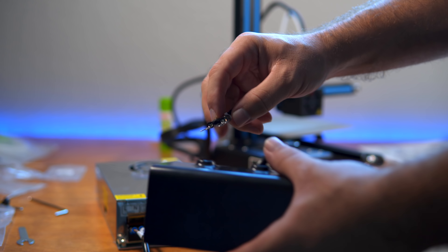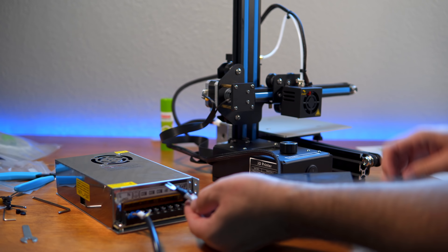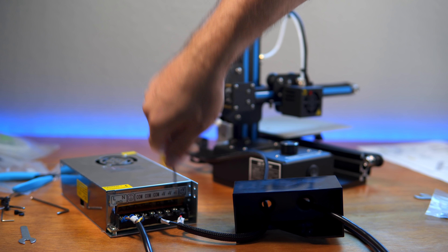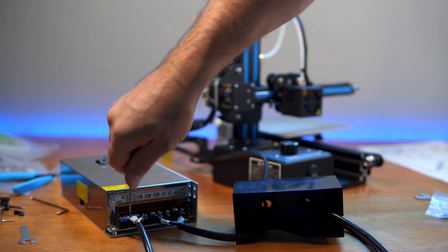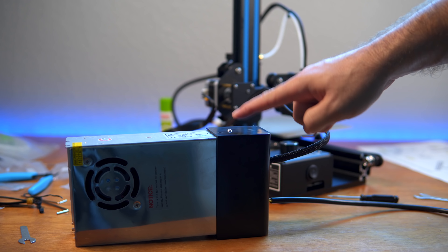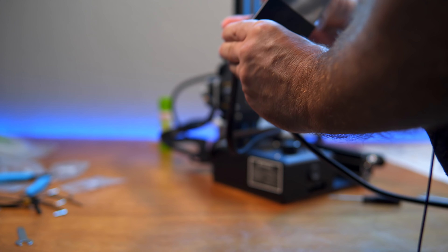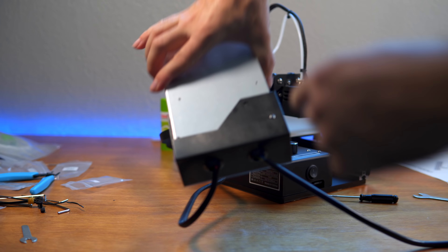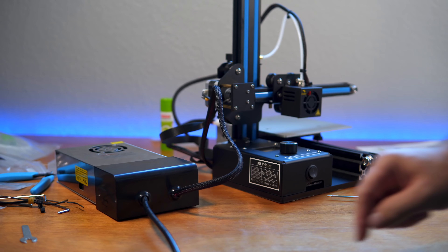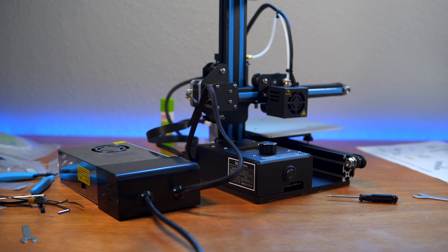For the output to the printer, run the wires through — the red wire goes on V-plus and the black on the comm/negative. Make sure everything is tight. We can put the cover on secured with two bolts. The wiring is a little concerning in that you can pull on things and wires could come loose, but it's all together now. Last thing — peeling the backing and sticking the print surface sticker on the bed, trying to line it up before pressing it down.